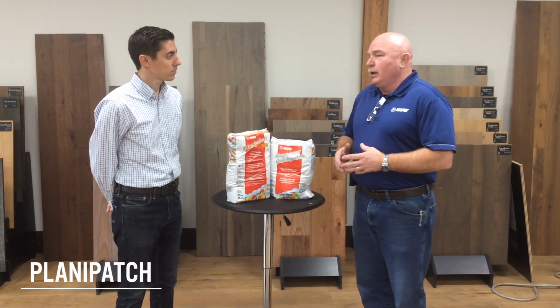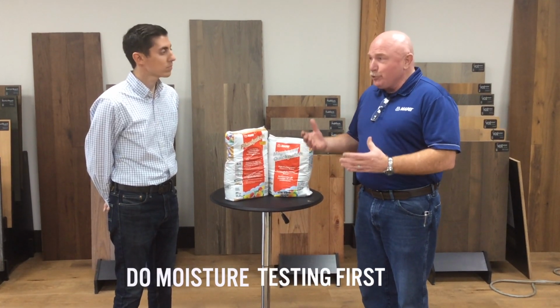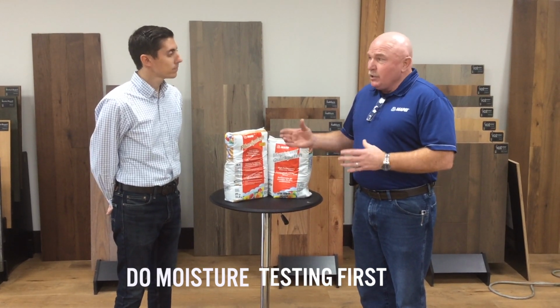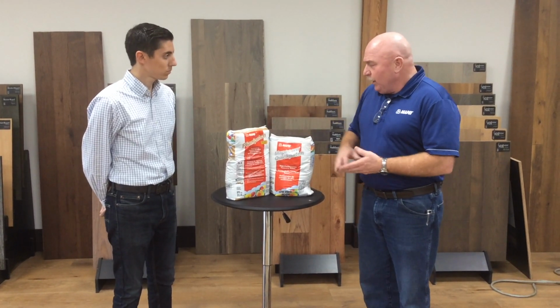Planipatch is a product where you need to know what kind of moisture you're dealing with, because it does have a limit of 5 pounds or 85% RH. So you need to do some moisture testing to know that this is the patch to use for you.